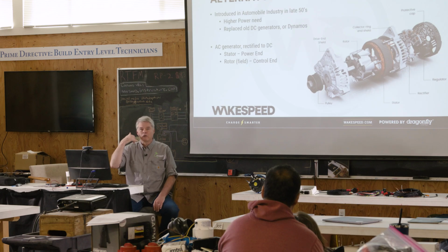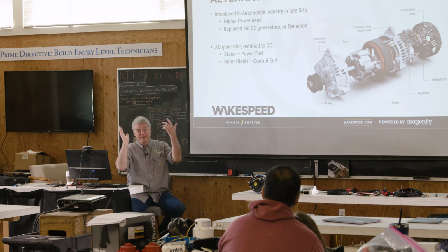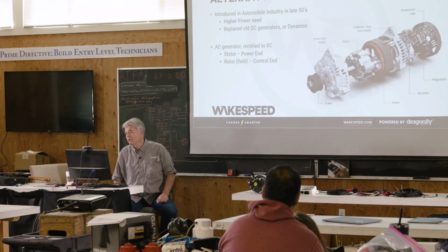Which, by the way, and I'm sure everyone knows this, is why the customer complaint: my batteries are full and my tach stopped working. What's wrong? You don't need the output of the alternator. You're not putting any input into it. You're not getting any AC waveform, and your tach just stops working.